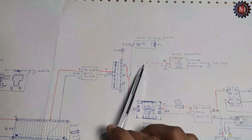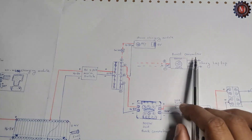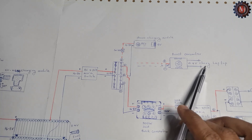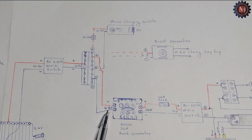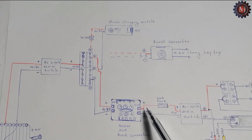If you want, you can take the 16.8 volt line to a boost converter, then boost the voltage to 19.4V or any voltage, and you can charge your laptops. Then I take another 16.8 volt output to a 300 watt 20 ampere buck converter. I connect the 16.8 volt to the buck converter input plus and minus, then I adjust the buck converter output voltage to 12 volt and take 12 volt output from it.